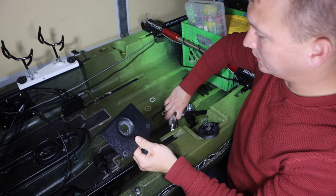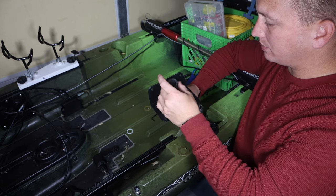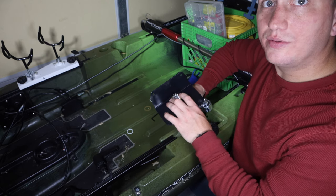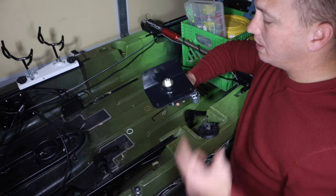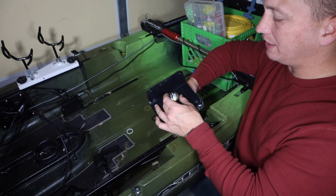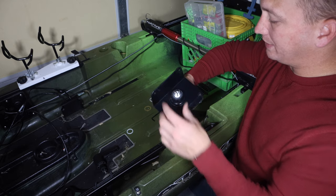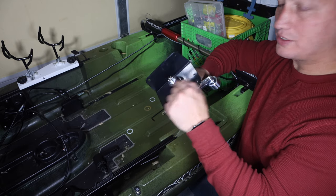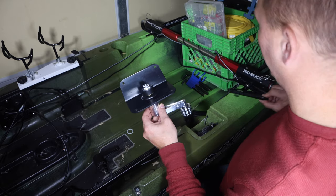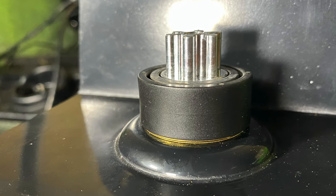So we're down here, we've got the plate. The best way to try this out is to put your spacer or stock spacer on here and then try out these shims. I found that for my specific scenario, two brass shims seems to be the best. But if you try to put it on there like that without everything undone, it's going to be really hard to keep those shims in place. So what I did is I took the shims, put them down on there first, and then took the spacer. You want to make sure it's all flat — you want to make sure that the top of the spacer is level with the top of the machine portion where the splines start.